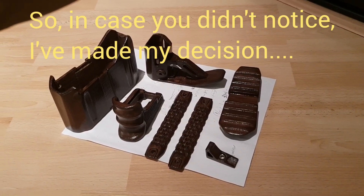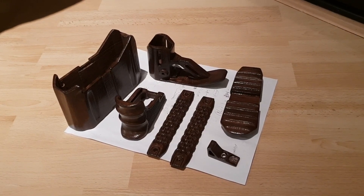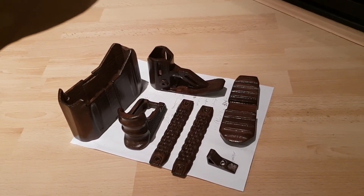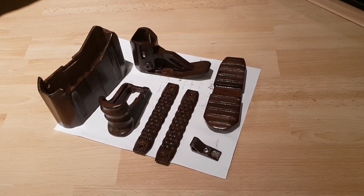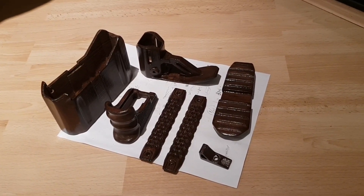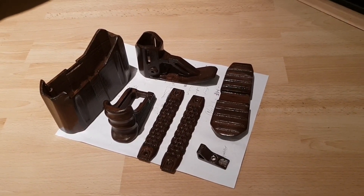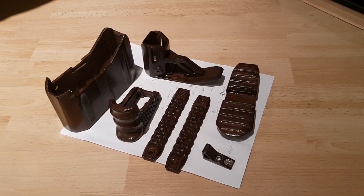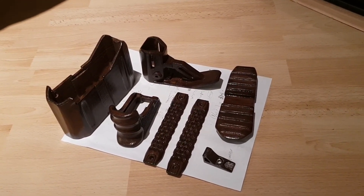I'm back. I slept on the decision of whether I want to put a clear coat on it, and yes — I put four clear coats. I was using water-based polyurethane on the stained surface. For polyurethane, you have to lightly sand it between coats. Three coats are minimum, and four coats provide even better protection.